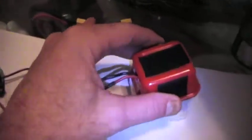These wires I was talking about earlier would have been soldered right up underneath here. What he's done for me, like I did on my other unit at my request, is replace all those with longer servo leads so that I can spread these components out throughout the plane and just mount the speaker in any location I want. My particular one is mounted in the bottom of the airplane.